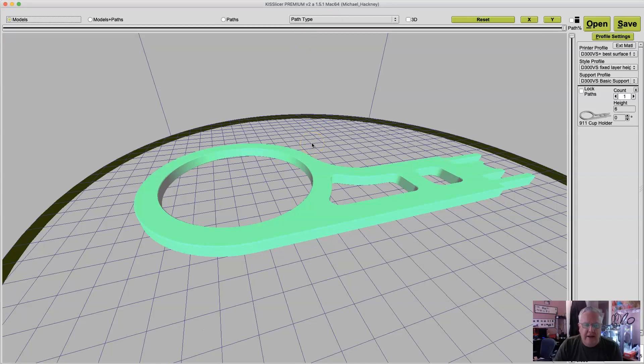The feature today is ironing. A lot of us have asked for ironing over the last couple of years, and now KISSlicer has its own implementation of ironing, which is really nice. For those who don't know what it is, ironing is basically taking a final pass over your printed part without extruding plastic. In KISSlicer, it's a final pass with just a heated nozzle, no plastic extrusion. The idea is to smooth out the top surface, filling in those ridge lines between the extrusions. I have a photograph of a part where I stopped halfway through ironing so you can really see the marked difference in quality between the ironed and non-ironed sections.